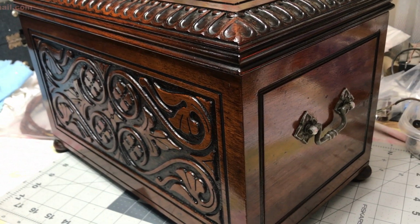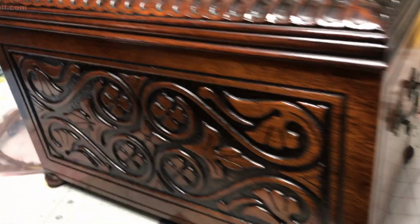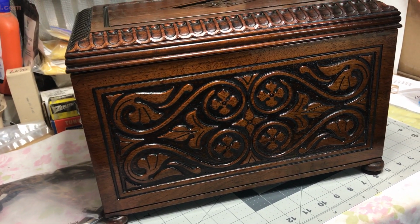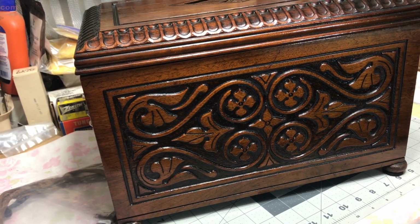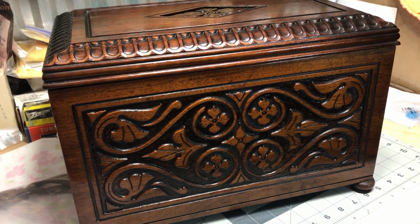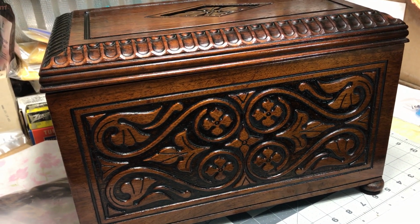The one thing I wanted to cover too, also in the regular video, was the better the antenna, the better the reception. My antennas are really not high tech, but they are long. That's one version where they call them long wires. My antennas are about 50 feet minimum, I think. I think that might be the length that I have. I haven't really measured them. But they stretch out there and they go different directions. So, the better the antenna you can put on these, the better the reception is going to be.